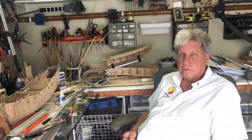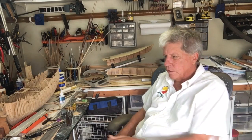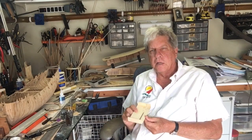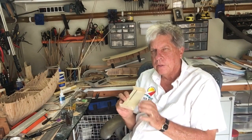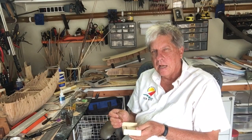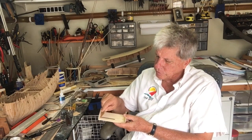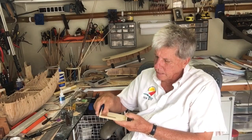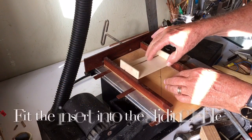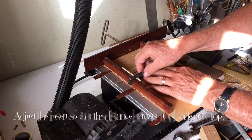The last method turns out to be the best so far in making the groove buttons, and it uses a modification to the Jim Burns sliding table — I had an inner sled made up that fits in the Jim Burns sliding table. The sled has a little ridge on it which is the same thickness as the groove button. It establishes the first cut, and then each time a new cut is made you simply move the bulk stock down, clip it in, and establish a new cut. You place the insert into the sliding table, adjusting the distance between the blade and the stop on the insert to be the thickness of the groove button.